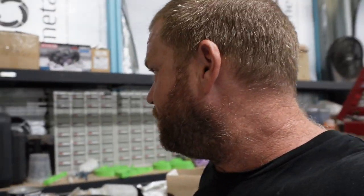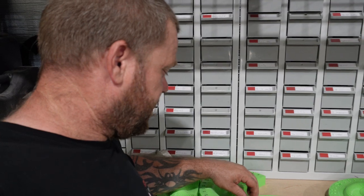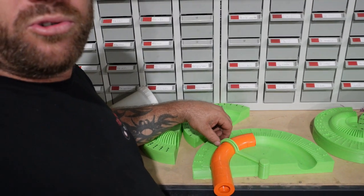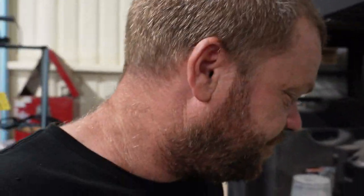But yeah, I've been having fun with this thing. It's pretty cool. I've always wanted one, and it's very handy. That's like a 4-inch. That's what's this one? 1.75 inch, 4-inch centerline radius. So as you're at your car and using a protractor or whatever to work out your angle, you can come along and just put that to the angle you want, mark it, take it to your bandsaw, cut it, use a grinder, do whatever you want, just cut the thing. But you can accurately mark it, and it goes up in 2.5 degree intervals. Doing my head in is very easy, I must say.